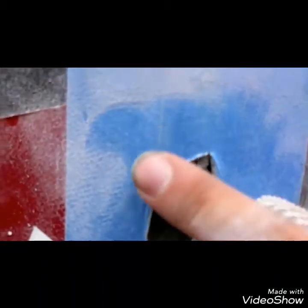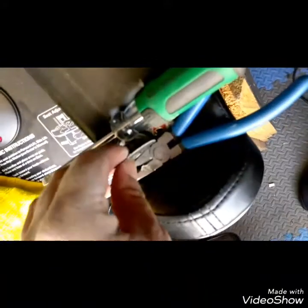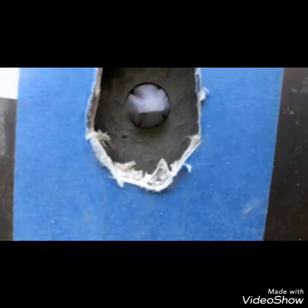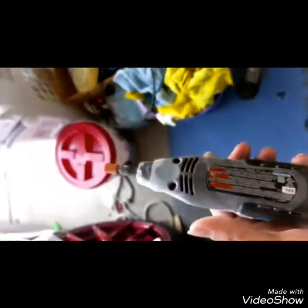Here's round one. You can see the cut's not perfect at all — it's not supposed to be, because it's a circular object you're trying to cut with a blade that small, and a blade doesn't do circles that well. You can see I left myself a little bit of room on all the sides. Now we're going to take the Dremel again, but this time instead of cutting we're going to use the grinder pad and just go around a few times trying to make it into the shape it needs to be.